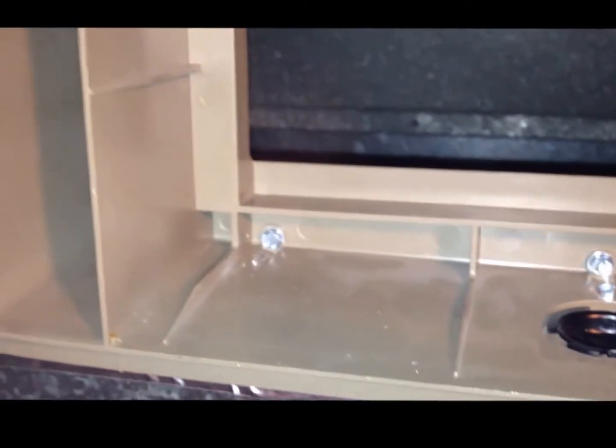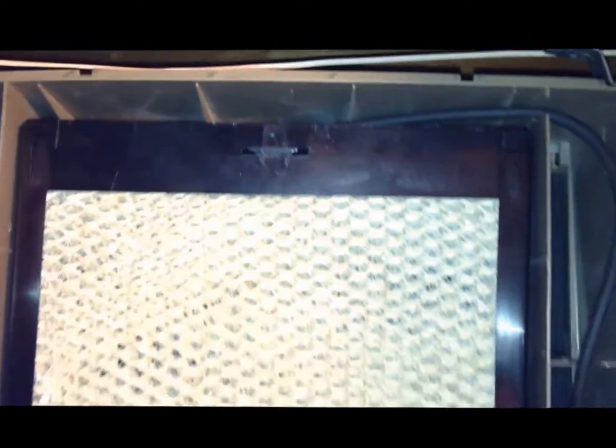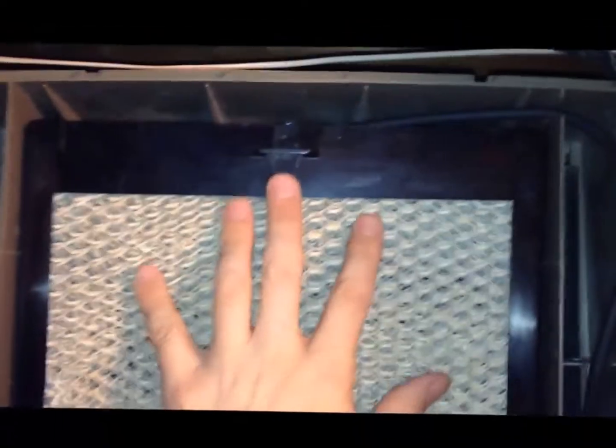Once you've got the hole cut and the frame installed, you have to put six screws around the peripheral edge. You'll have to drill them and install them — they're not self-tappers. Next, you reinsert the pad. This is a brand new pad; it looks like it's been used, but that's how they look new. Make sure you run your tube along the edge and insert it up top — that's where the water comes in. The water drips and flows over the pad, and the air movement pushes that humidity into the air.